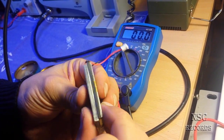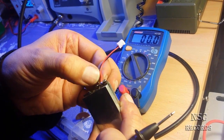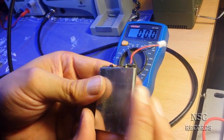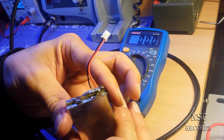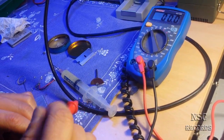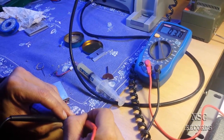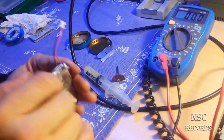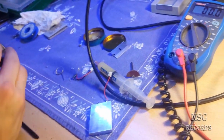I can see it's great. Let's put the soldering station away. Checking again — you can go over here and really move it. If you see it is hard and not getting removed, then you know it is really soldered great. Then just take care that you don't bring the batteries together with plus and minus. Now take some electrical tape to isolate.